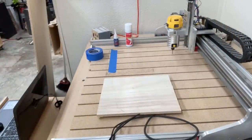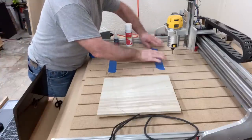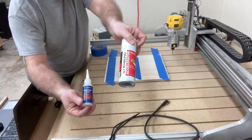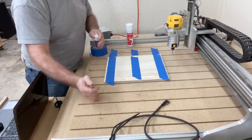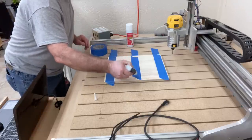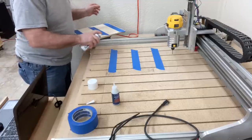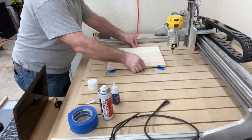Now the basic cabinet is finished and it's time to make the bracket for the hinges. To do that I'm using my glue and tape method to secure this 12 by 14 inch board to the CNC machine. This is just regular blue tape and I'm using the Starbond medium glue to hold it in place — I've used this many times and absolutely love this hold-down method. A link is in the description and you can purchase the Starbond glue with a 15% discount. It only takes a small amount of glue — you put glue on one side, spray accelerator on the tape of the other side, stick them together, hold for a couple of moments, and it's secure.